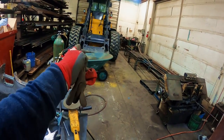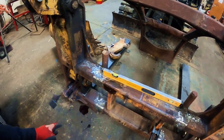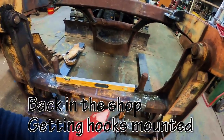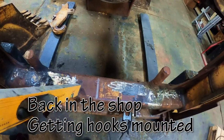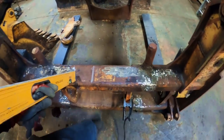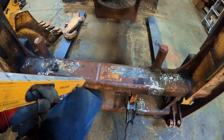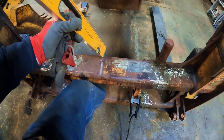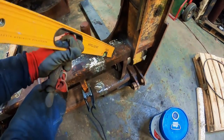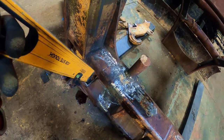All right, so quick summary. I measured outside to inside 39.5. That's my center. Add 1.5 inches, because that's the thickness of these, and you come up with 40.5. So 40.5 divided by 2 is 20 and a quarter. God dang it. Excuse me, 41 inches. So 41 inches divided by half of 41 inches is 20.5. So I measured from the center line, which you always put a C on, to the outside, the 20.5. Put your X on the inside. I learned that from my father-in-law. That's a carpentry thing. And then I measured from there over to here, 41.